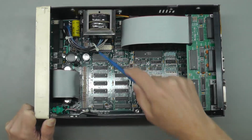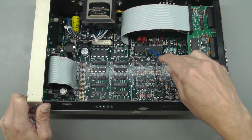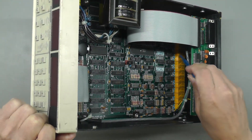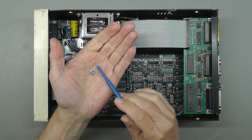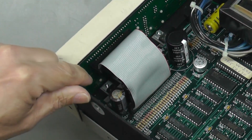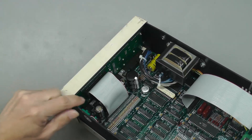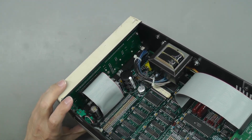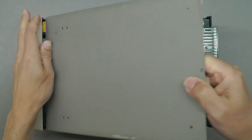Over at this side of the board is all the acquisition hardware: the TC850CPL, a 15-bit A-to-D converter — old-school A-to-D — and underneath there's a whole bank of relays, obviously for switching in and out the thermocouples as required. As for that loose nut and insulating kit — I found them. There's a TO220 device down here missing its nut and insulating kit, so that will be relatively easy to fix. Let's just hope that nut floating around all the circuitry hasn't done any damage. Let's lift the cover on the bottom side.